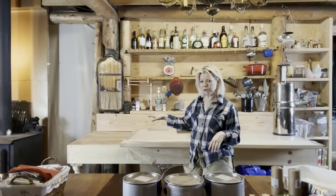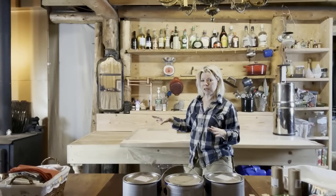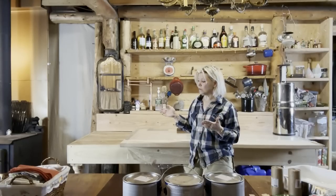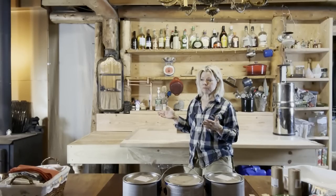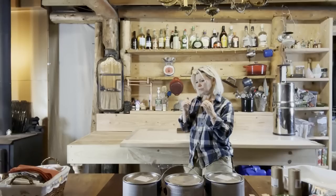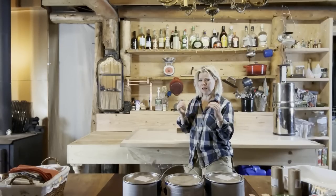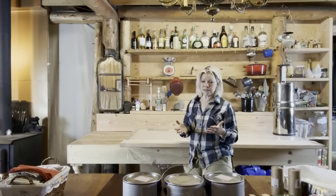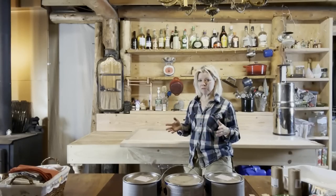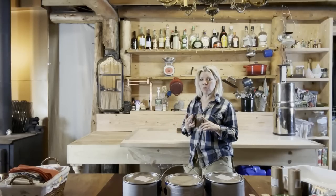Yes, I could have put wood filler in there, but it doesn't necessarily stain the same way that wood will. Also, one of the problems with using wood filler is that eventually it has the potential to crack and pop out of there. It's also going to mean that food and juices from anything could seep into any imperfections, and then that's not sanitary. I wanted a usable work surface that I didn't have to rely upon caulking or wood filler or anything like that.